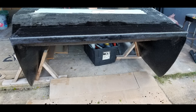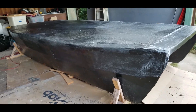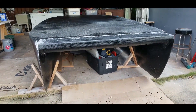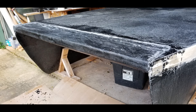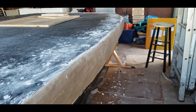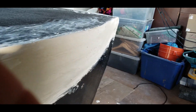Looking good! It's really nice to see the deck connecting with the cross supports underneath. Once the resin is cured on the front here, I come in with a sander and knock down the edges. Bit by bit and layer by layer, we're filling in that erratic junction between the deck and the sides of the pontoons. The goal, of course, is to give this a smoother, more faired side.